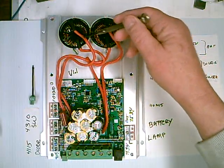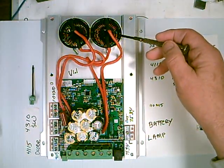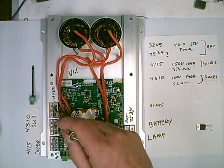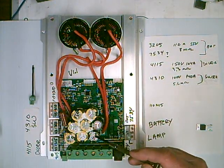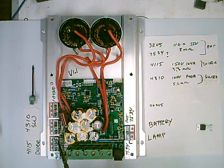You've got two nice big inductors in aluminum pods mounted on a big heat sink. These inductors actually produce more heat than the FETs themselves. We have four 4310 FETs over here and those do the switching. These are the input caps — 560 microfarads, six of them. The output caps are 2700 microfarads and there are two of those. They're all 100 volts. These 4115s are used as the diode. Any FET has a body diode in itself, and when you turn these on, the forward voltage drops even lower so you get more efficiency.